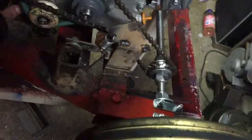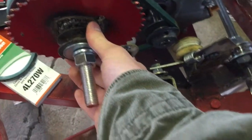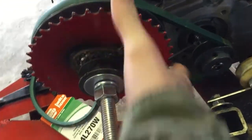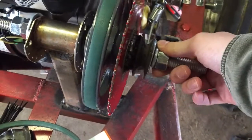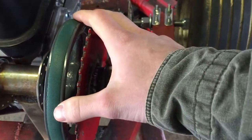This thing is just hauling around. That spring might not even be tight enough — I thought it was going to be too tight. I got this threaded rod at Lowe's and a big new pulley, so that's going to go on here like that. Last time we tried to start it the pulley was too small — it had this little belt and it couldn't spin the whole thing. So we got a bigger pulley and a bigger belt. Got the threaded rod on. We just need to hook up the chain and see if it can spin the tires now — it should be able to with this big pulley.